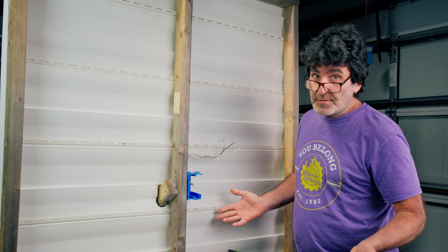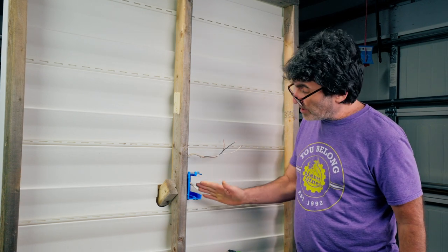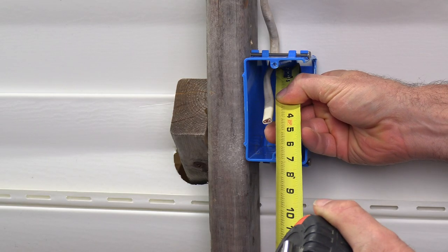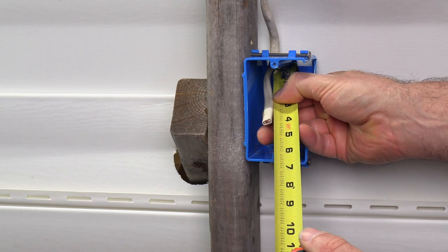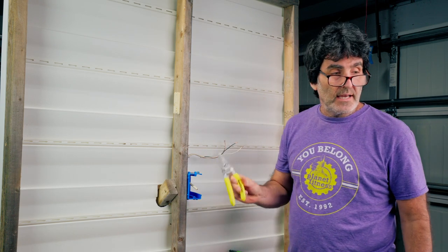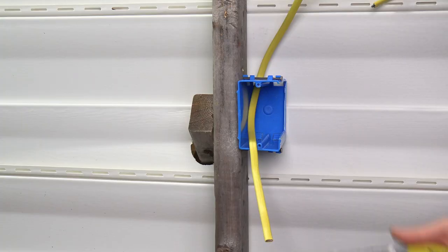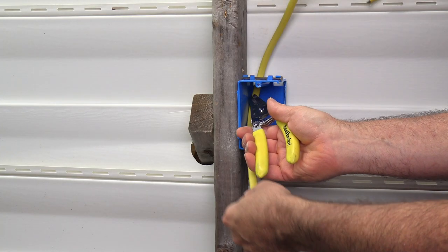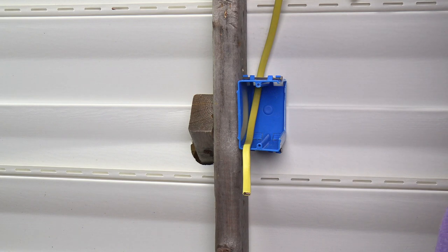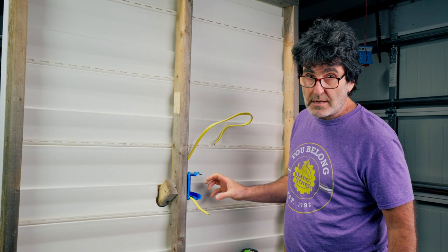Moving on to number three — I've seen this one a lot. It's not pushing enough wire into the box. You need at least six inches from the back of the box. As you can see here, we barely have four inches. A fast and easy way to check: I'll take my cutters, which are about seven and a half inches long, stick them toward the back of the box, mark it with my thumb, and cut. That's usually about right every time. Short wires coming out of the box make it very difficult to hook up your outlet or switch, and difficult for someone down the road working on it.